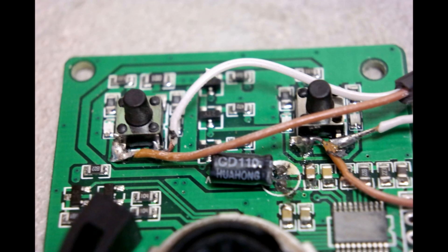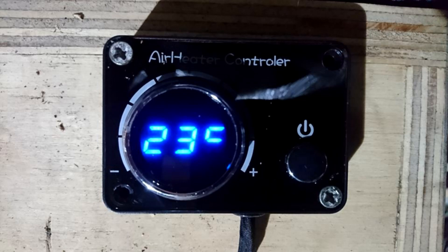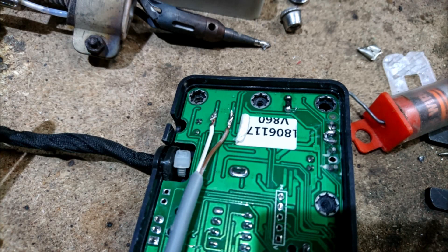If you're like me, you just need on only - and with a single GSM module it would be the left one, the on button, that you'll be soldering into. Then Henk upgraded and got the new style with the new heater - it's got the temperature display in the middle. Note there's a single button on this one - you press it with one short push for on and a hold longer for off, a bit like the old style LCD controller. You need a single channel GSM module to hack into the back of this one, and you program it differently with a long hold and a short hold.